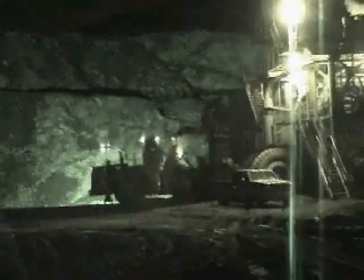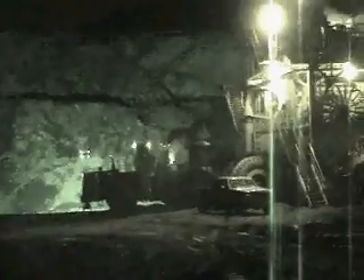Due to California's current energy crisis, Granite Rock is running its main production shift at night time. You can see a 992 loader here feeding that large Krupp mobile crusher. With safety always being a primary concern at Granite Rock, the area is well lit with mobile light plants. What we're seeing here is a view atop that mobile Krupp crusher. In the top right corner of the screen, you'll see the 992 loader feeding the hopper, and we've got material coming up what we call a pan feeder. Material is conveyed up the pan feeder and then into the jaws of the Krupp.